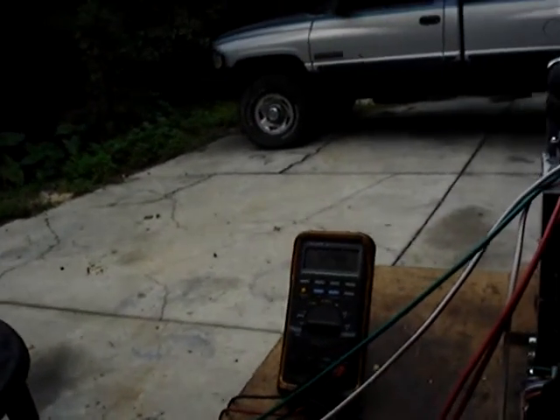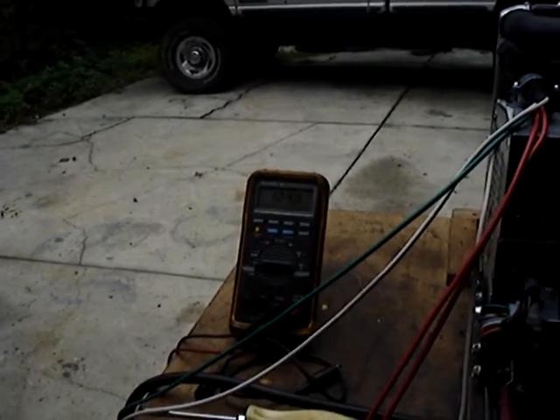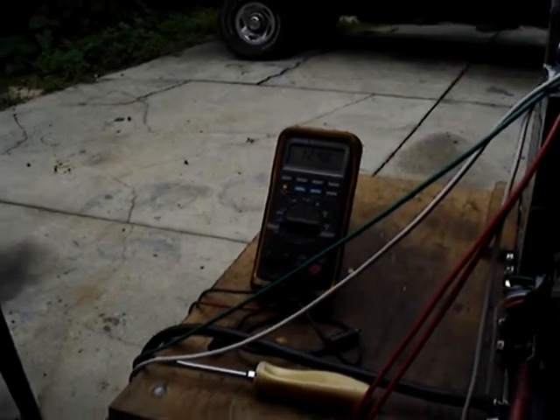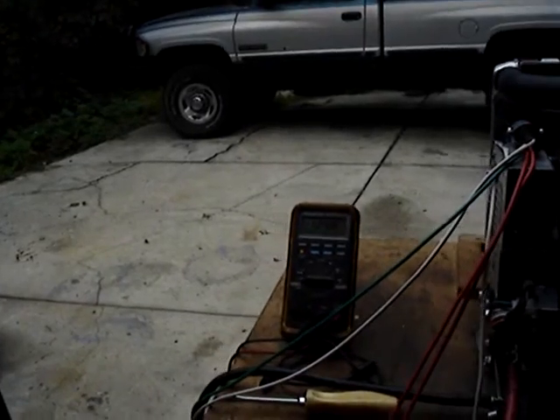Here's an additional 2,000 watts. That's a 4,000 watt load applied to it right now. I don't like to go all the way to 6,000 watts on a brand new engine. I like to break them in for a couple of hours first.